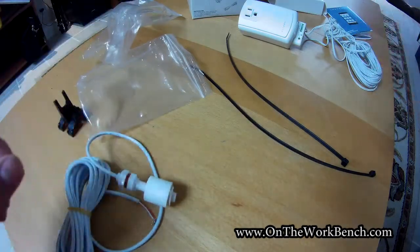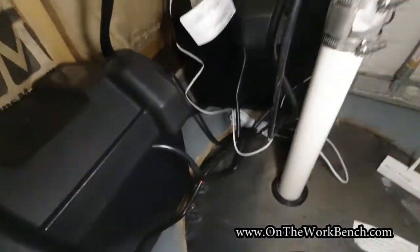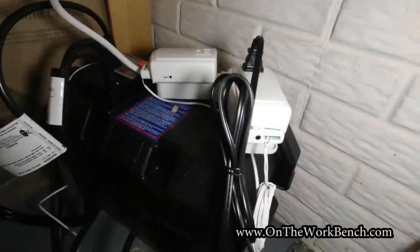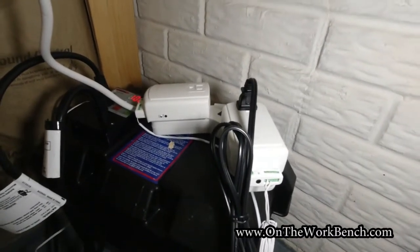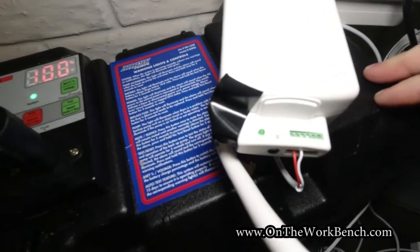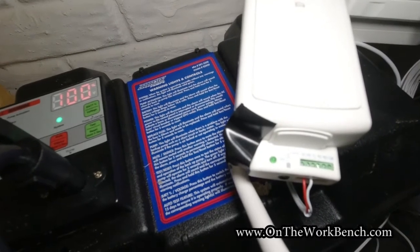Now we'll jump to how to wire this. Here's what that sensor looks like set up in the sump pit. The white wire coming out of the pit is the sensor coming up and out, and that goes up to an Insteon I-O bridge link that is then connected into my Insteon system. That counts the number of times that switch is activated and gives me a report in Home Assistant. The red and white wires from the sensor are connected to the ground and the signal port on the Insteon I.O. device.